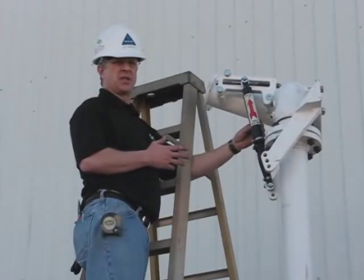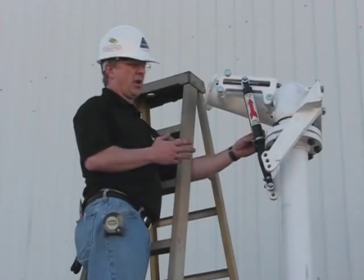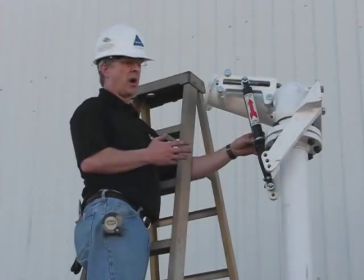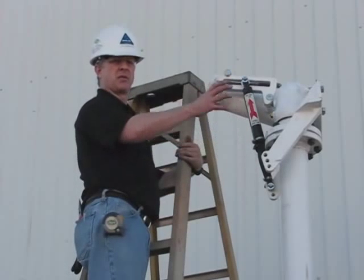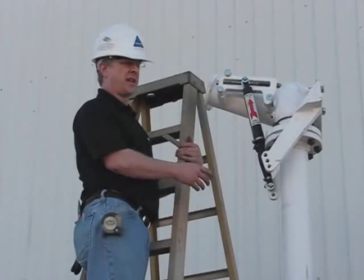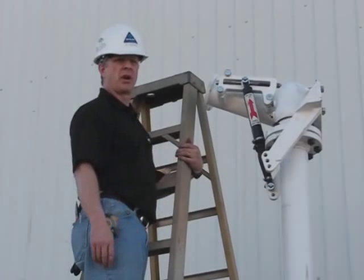You might think, put these struts on the ground, but we've waited till we got the counterbalance up, just because we don't want to damage the struts while we're raising it and mounting it up here. If the counterbalance assembly was swinging or something, you don't want any dings in the shaft of the gas spring, just like you wouldn't want a ding in a hydraulic strut.